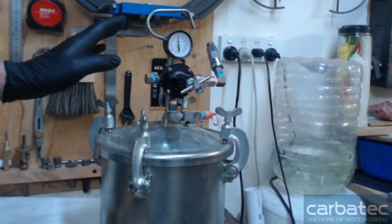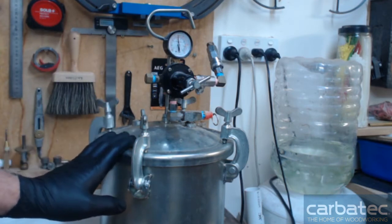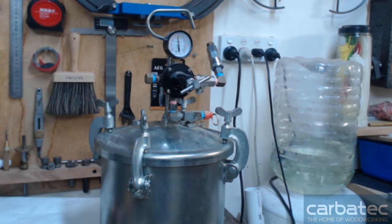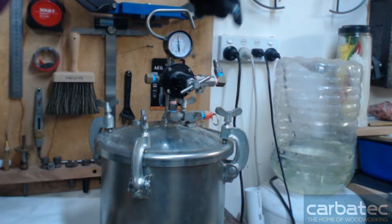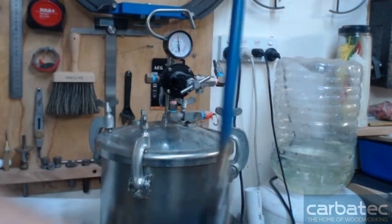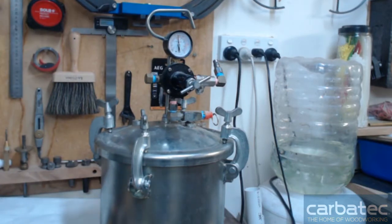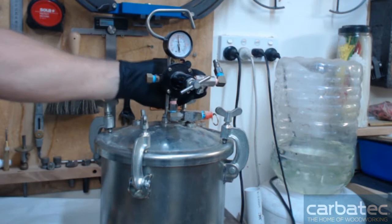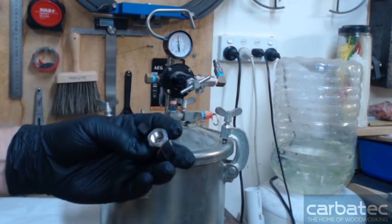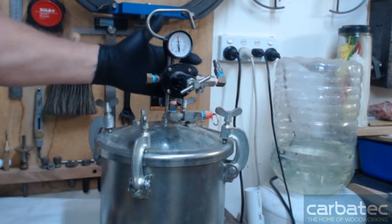This is the pressure pot I use — it's 50 psi and was pressurised last night. It's a standard cheap paint pressure pot, but you do have to do some modifications before you can use it. One of the things I've done is add an extra connector that's blanked off, so when I disconnect the main feed it seals it. Also having a good locking mechanism at the back is important. I originally had a small ball cock valve and found it leaked, whereas going to this larger arrangement it's fine.